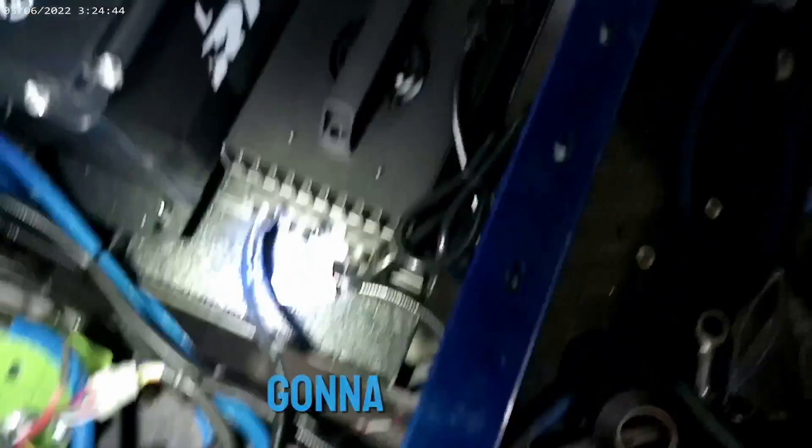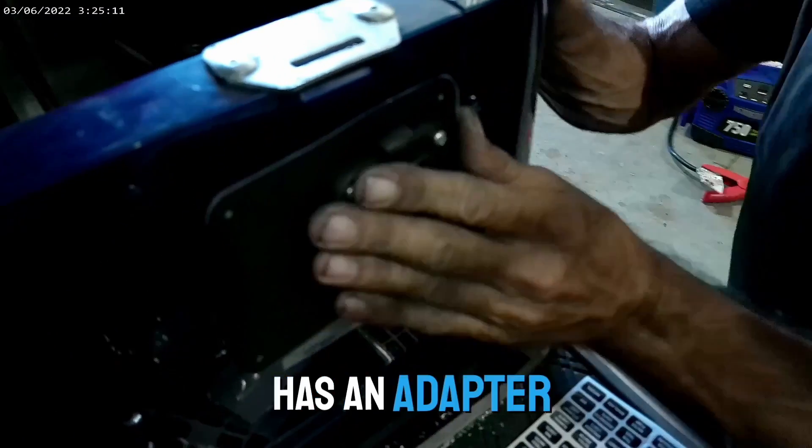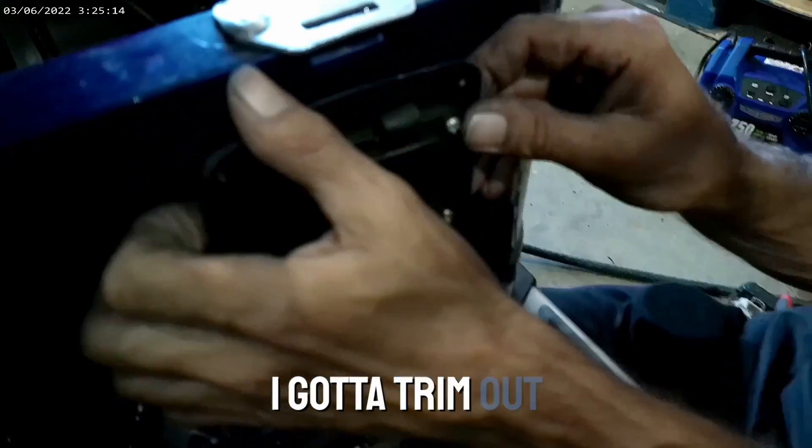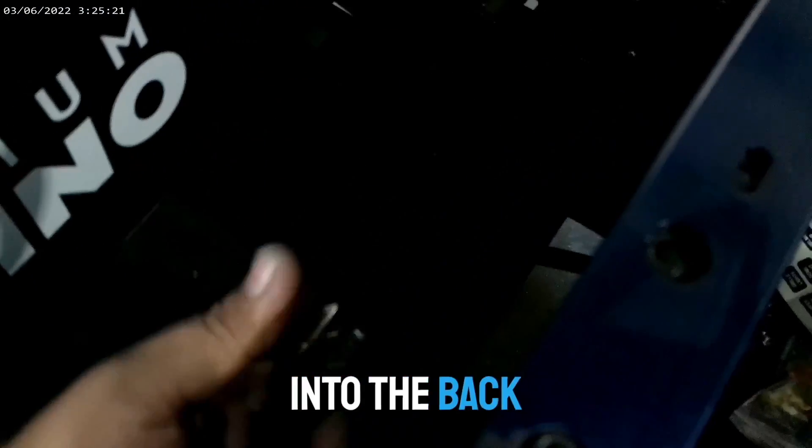So we've got the battery in; we'll wire it up here. Now we're going to get this charger installed. We have the two wires coming off the battery here — they go to this plug, and this plug just plugs into here. On the AC side, what we like to do is install the charger on board so you can just plug in an extension cord. Eric over here has an adapter plate that we made. We've got to trim out behind it a little bit — that's going to go in right there with an AC port — and then this will just plug into the back of the AC port.